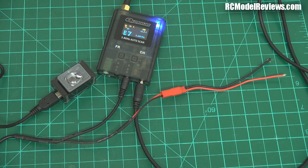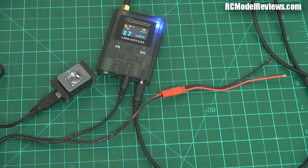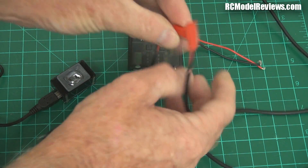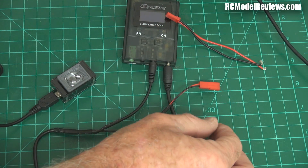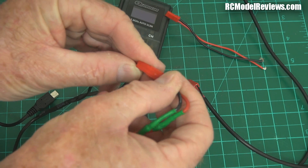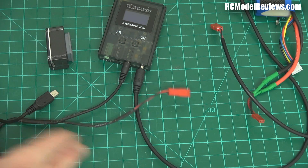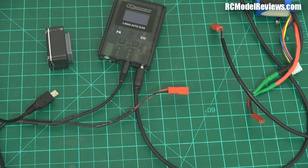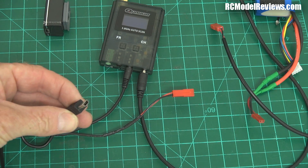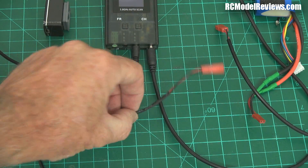Is it this connector that's wrong or is that one wrong? I don't know. I'm going to check using another battery's JST plug that I know is wired correctly. It's this lead that came with the eyepiece that is wired incorrectly. But I'm not going to rely on just the colour coding because I just don't trust it - I'm going to have to actually check the pinouts on this. And even that's probably not going to be USB standard because it's not a standard USB connection. What do you do when you get gear like this which is obviously just waiting to be exploded?